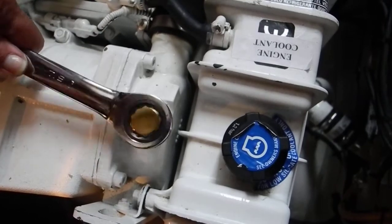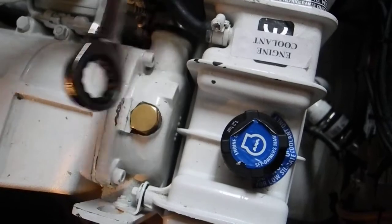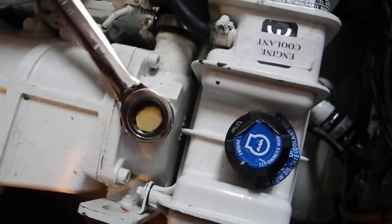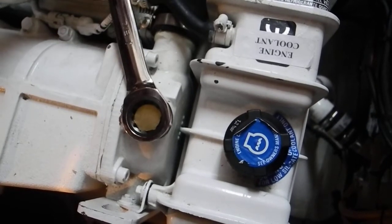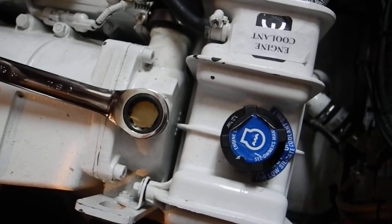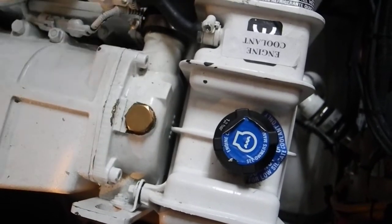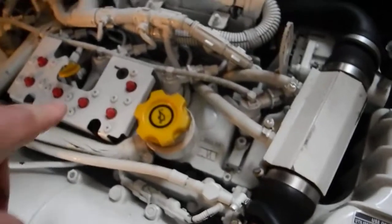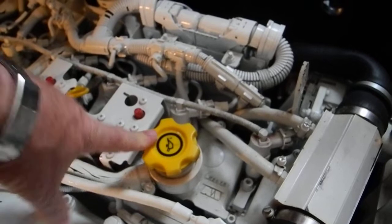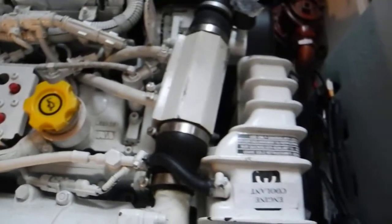Flip the wrench over. Just one oomph — that's it, no more. So we just changed the zinc, and then we'll check the oil right here. We'll take this off to put that big plastic cover back in place and put that back together again — easy as pie.